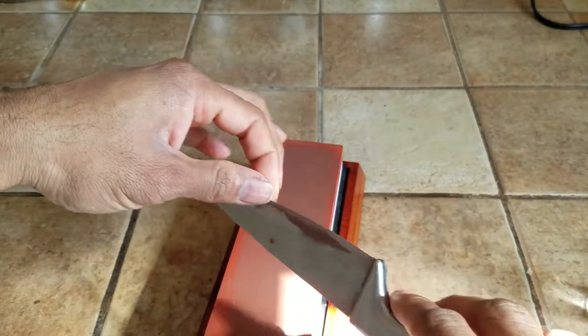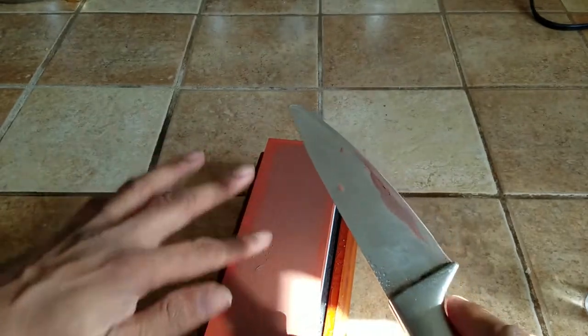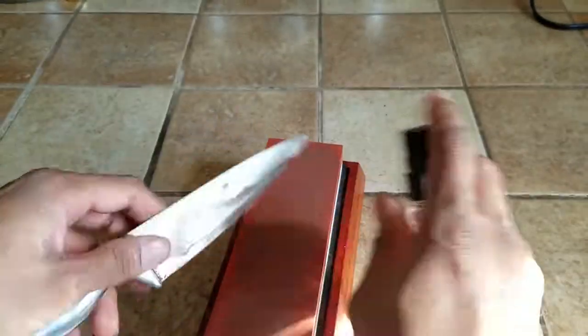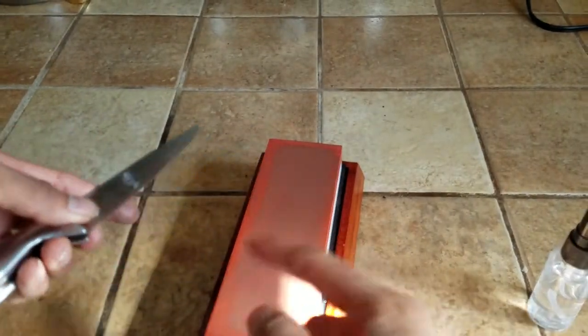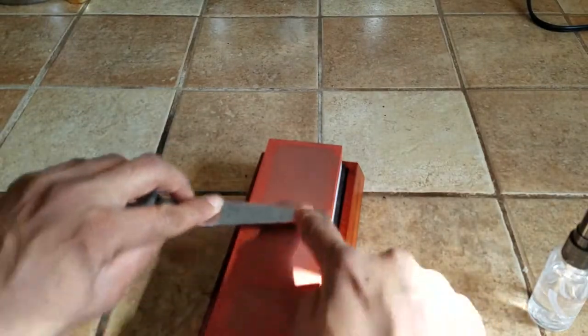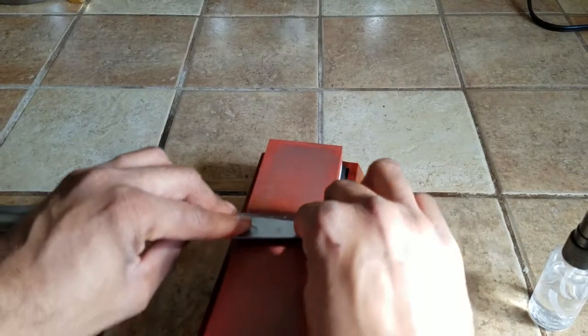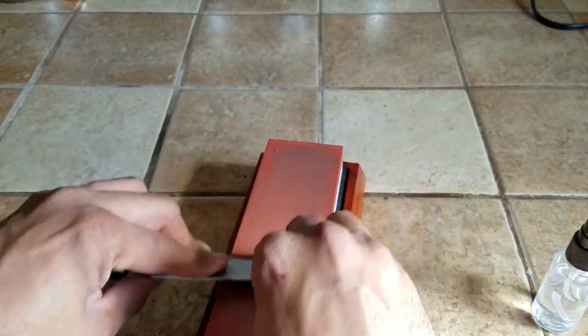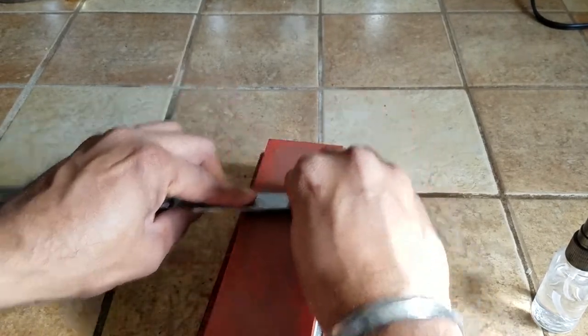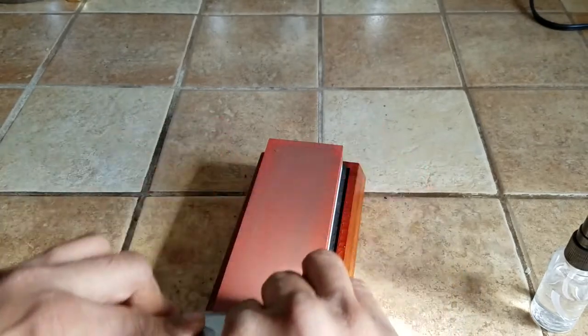All right, one side is done, and very carefully, again, this is the dull edge that's there. It has started to take an edge. I'm going to continue on to the other side, and then we'll switch onto the other side. Same step, I'm going to follow on the front side. Again, no pressure, only put the pressure when you're pushing the stone back. The main reason you're doing the front part is to pick up all this slurry that you have.